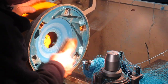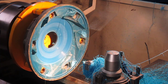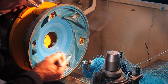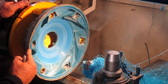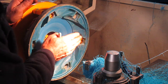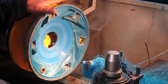So this particular one I've taken off quite a substantial amount, simply because it was badly chewed away in the eye here where the impeller runs against. Some of them are a lot less and easier to clean up, some of them are more difficult. Now I'll mark the depth that I've cut here, so that when I come to cut this edge and this edge, and counterbore these six holes, they will all be the same. And the impeller will sit, when it's all put together, at the correct distance away from the face. I'm giving these a new life — I do them from time to time, and it works, it's a very good system.